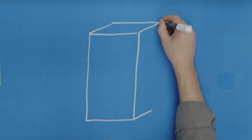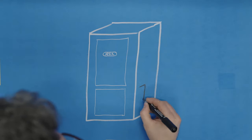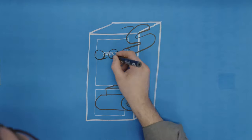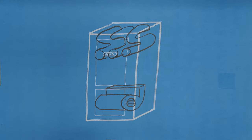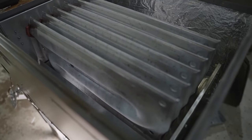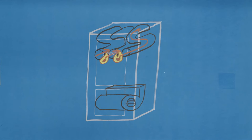90% and above efficient furnaces actually heat the air twice. As part of a regular cycle, the blower motor pushes the air past the primary heat exchanger. This is essentially a large metal pipe bent in curves, and inside the pipe is where the gas is burnt. The burning gas makes a lot of heat and in turn heats the pipe up as well. The blower motor moves air around the hot pipe, which in turn heats the air.